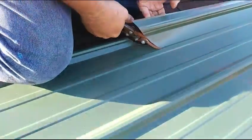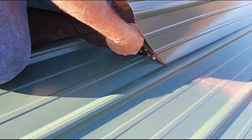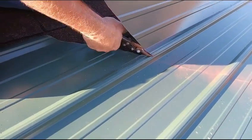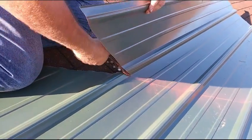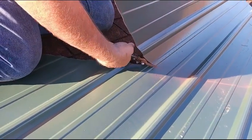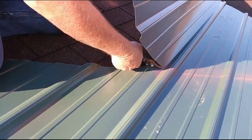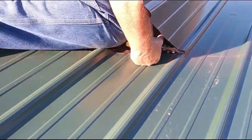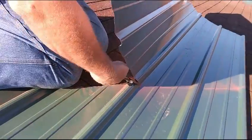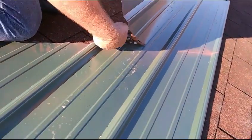One of the tricks I was showing to people earlier is I lift up on one side and hold down the other, so I kind of encourage it to tear, and then I use the snips to tell it where to tear. I've got my snips turned a little bit sideways so I don't have to interfere with the way the metal pulls up.